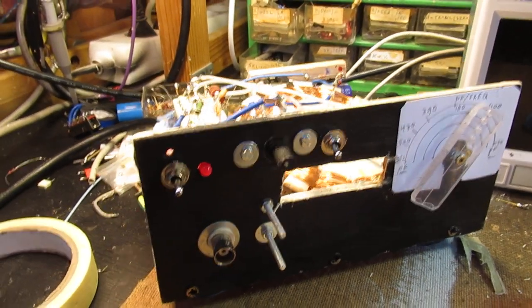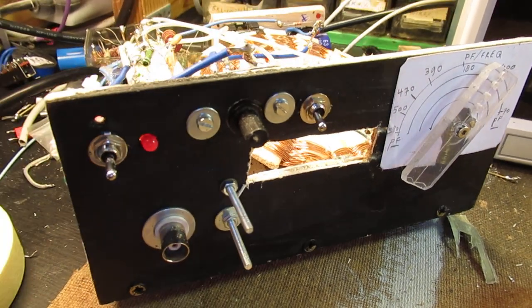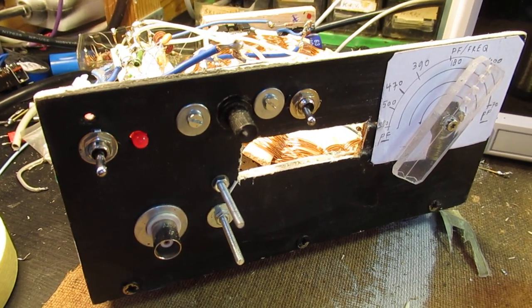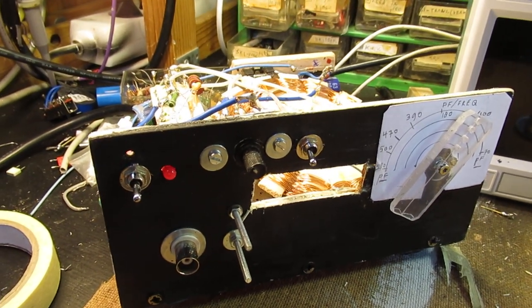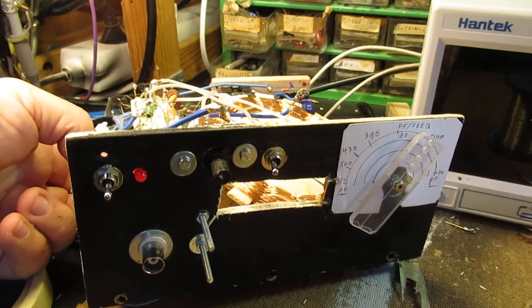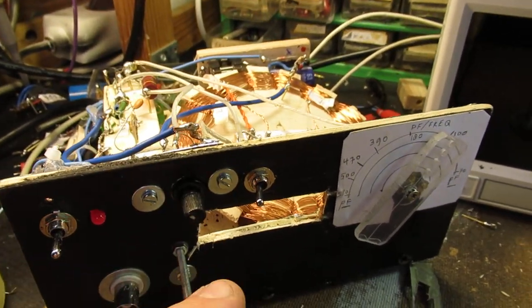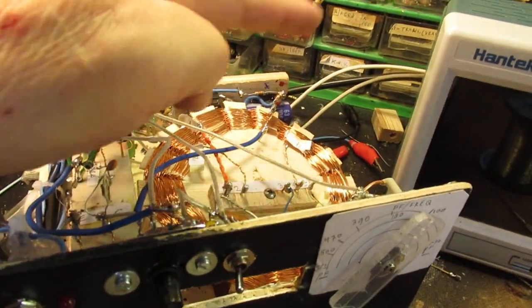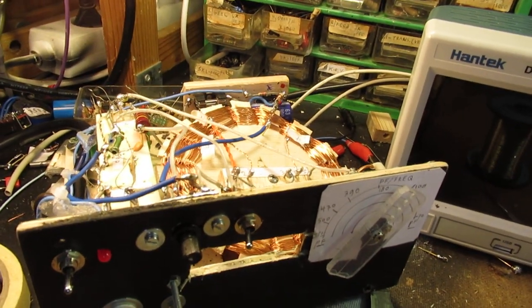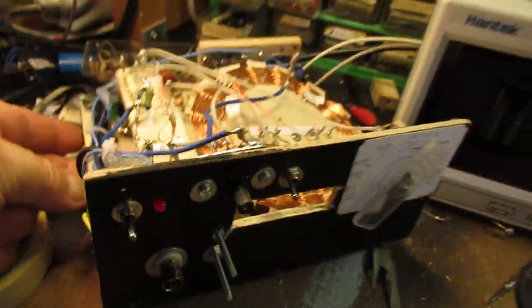The only thing that I wanted to tell is when you want to wire, say, more or less complicated circuits, it's always a very good idea to do that separately. So, for instance, take this switch out, wire it, put it in, and then you have two long wires here going from whatever location to another location. Of course, the wire must be long enough anyway. The same for potentiometers, etc., etc.